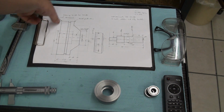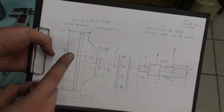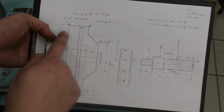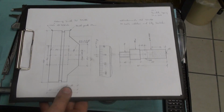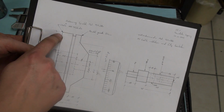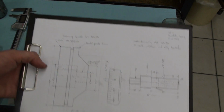And the dial, I have the drawing here, side view, is the next part we're going to machine. This is going to be turned also out of free cutting mild steel. We will knurl it, and yeah, it's not much to it. It's a pretty simple part.